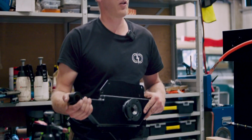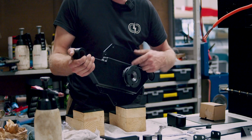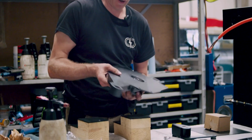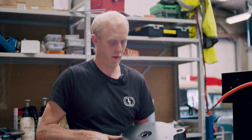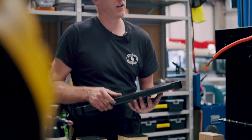As you can see, that's our motor backplate fully assembled with the output flange, the seal, bearing and the circlips that retain it all mounted. Dowel holes are drilled, so it's all ready to bolt up to the motor, and then the motor can go in the vehicle.